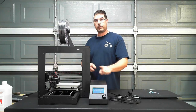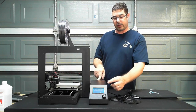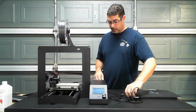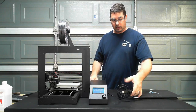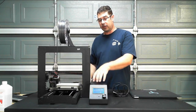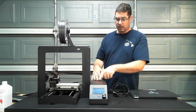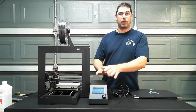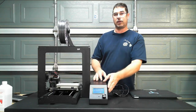Now, a couple of the limitations and things to note: you do lose the USB card and the USB port and the micro SD card slot that are active on the side of the Di3 box. Instead, you have a couple of different options. One is you can do what I did, and I just permanently connected a USB leash, basically, and ran it out of the box with the rest of the bundle, so I can just coil it up and tuck it beside it. If you needed to get to the micro SD externally, it's not included in the kit, but for just a few dollars off of Amazon or your favorite online retailer, you can pick up a micro SD extension, which you could run out the side of the box and basically give yourself a connection point to move the micro SD outside of the box. Unfortunately, because the board isn't designed exactly to the shape or the positioning of the Melzi, those controls are in different places, so they have to be extended some way.